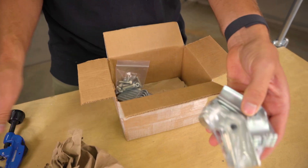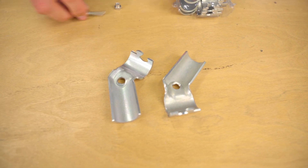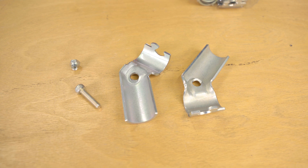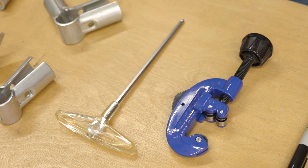Now that we have a good idea of how to use the 45 degree connector in builds, let's put one together. The 45 degree connector is made up of two pieces that you will find flat packed and sealed in your box. In addition to the connector pieces, you will also need one M6 nut and bolt. This hardware is included with your connector purchase and will be inside of a clear bag inside your package. To tighten the bolt you will need a single 5mm hex wrench.